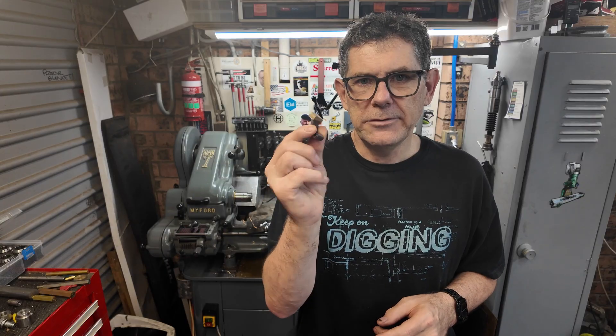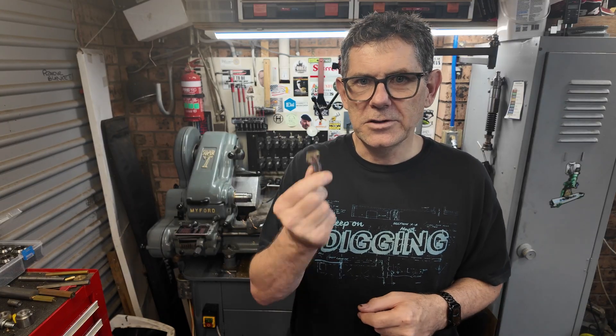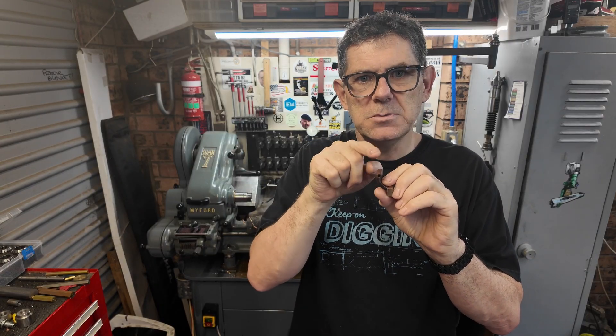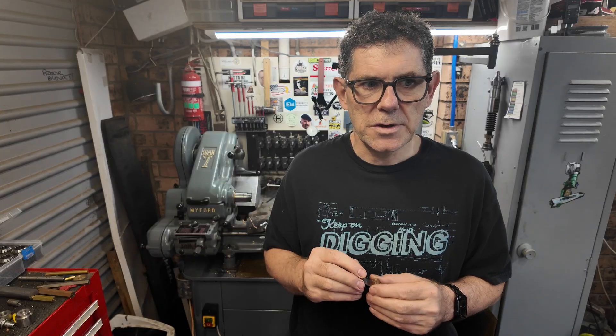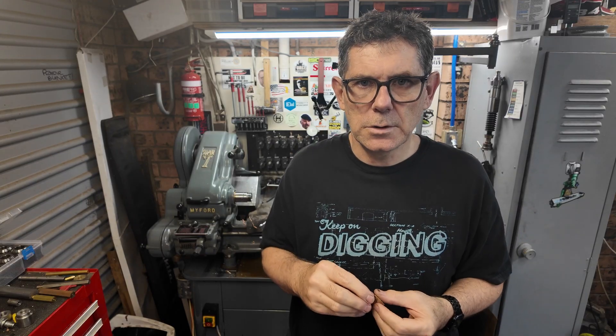I ended up having to make it again because I bought another set of castings for the governor, and that part has a little boss on the top. I did it all again and it was actually very much faster because I had all the jigs and knew what I was doing. Before then I would have said this is the most difficult part in the engine, but now with the right fixturing it's not too much of a drama. It's very important to do this first and use it to align the point where you need to drill on the steam chest. Knowing the exact position of this hole based on this gives you very good alignment, and it worked out very well. Thanks for watching.